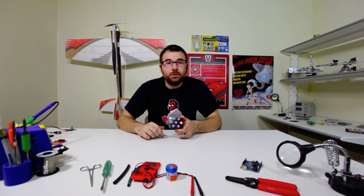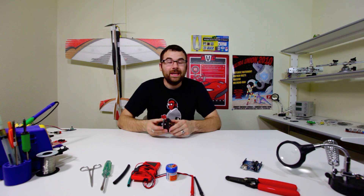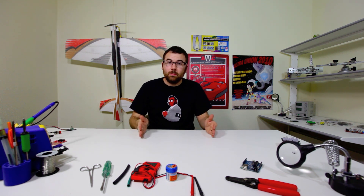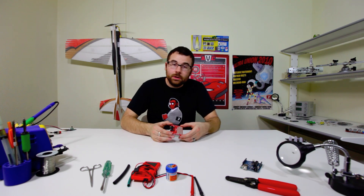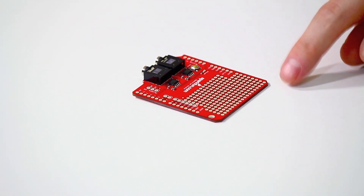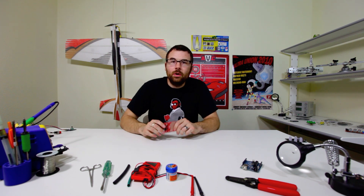Some of you might remember the Colorific Spectralizer from a couple weeks ago — a pretty cool kit. At the heart of it is the MSGEQ7 IC, which takes an audio input, separates it into seven different frequency bands, and gives you an analog voltage that you can read into a microcontroller to control LEDs or whatever else. We've put two of these on a shield so you can easily use this with your Arduino. Just feed it a left and right audio signal or a mono signal and it will give you an analog voltage for those seven frequency bands, cycling between each one. We've got some pretty cool example code up on the website.